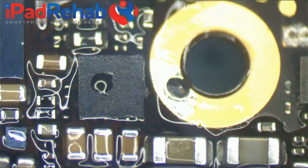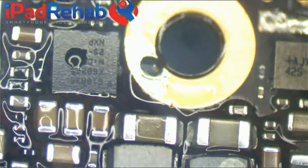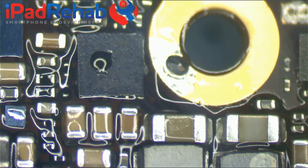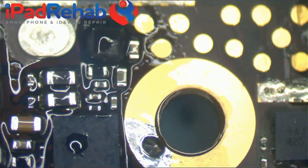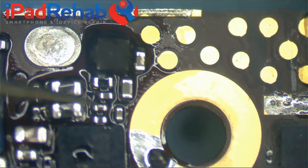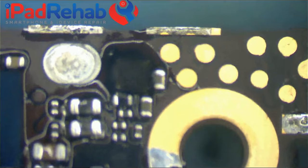All right, so we're gonna go ahead and install the new iPhone 7 TriStar, FYI, which is the 610A3B chip. So we'll go ahead and put this on here, and then I actually need to order some chips, and I'm going to use a new supplier that I'm super excited about. Because the business of stocking chips, ordering them from China, getting what you want, looking at them all is a real pain in the ass. So the guys that do domestic chip supply make life a lot easier. I'm a big fan of using new chips. They're not terribly expensive and it eliminates the variable.